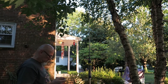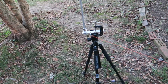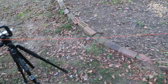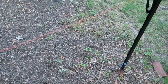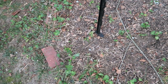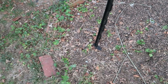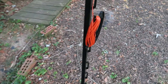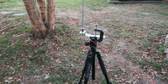I'm going to turn this a little to get it more level and straighter. The coil is supposed to be at five inches. I'll attach the counterpoise now. It's fully extended and doesn't look very tall really. The counterpoise for 20 meters is 17 feet. I walked it out measuring by stretching my arms. I'm using electric fence posts — they've got about an eight-inch spike on the end and a little step. I got them on Amazon for about two dollars each. For two bucks you can't beat it for supporting your counterpoise when there's no tree around.